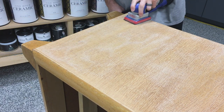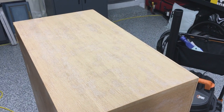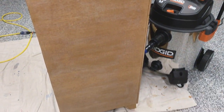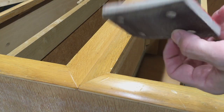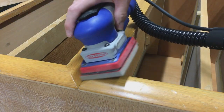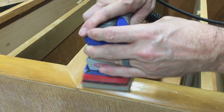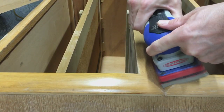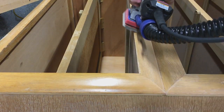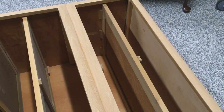I left it kind of blotchy because I was thinking about doing a wash initially, so I wasn't too concerned about uneven sanding. It was really just getting that old varnish off to have a base to figure out whether I'd try to restain it with some driftwood streakiness or not. The front was a whole other ball of wax, but thankfully I had the Surf Prep. Imagine trying to hand sand that curved edge all the way around the piece. I just decided to keep rolling with the sanding, and it was over in about an hour.